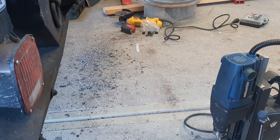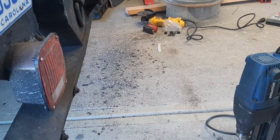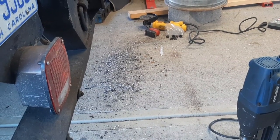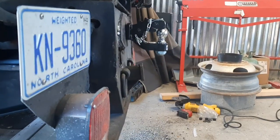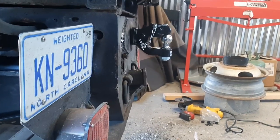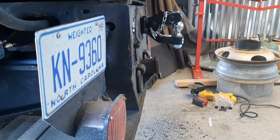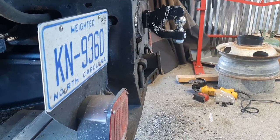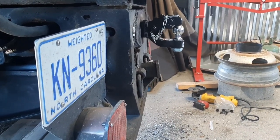I thought I had a hiccup here. I was looking at it going, I know I centered my plate in the center of the pintle hitch, so why is it not centered on the two inch receiver and tilting to one side a little bit — mathematically everything should be fine. Well, somebody rear ended this plate or something happened, and that's just throwing everything out of whack. Even that two inch receiver is kind of jacked sideways. So I'll just have to inform the customer that this is the best I could do considering the plate's all goofy.